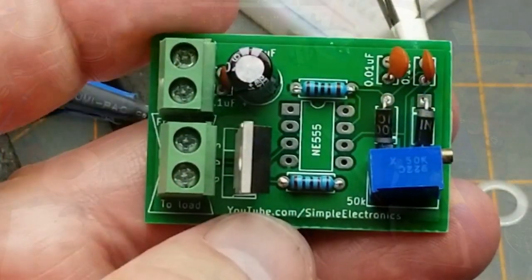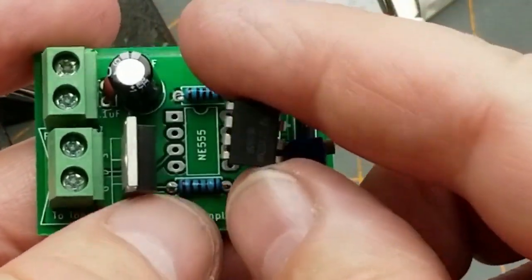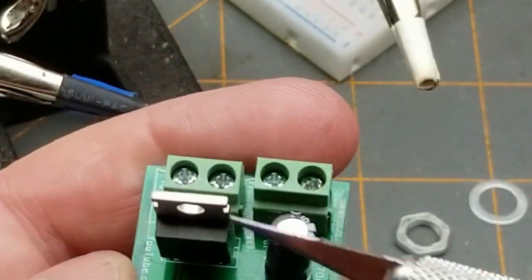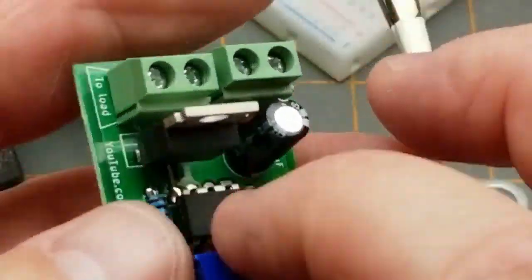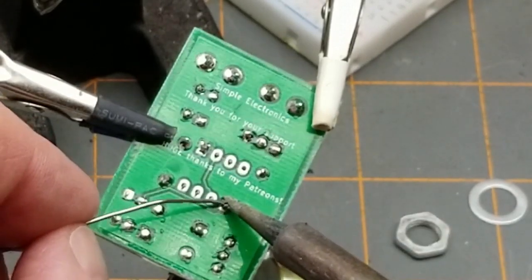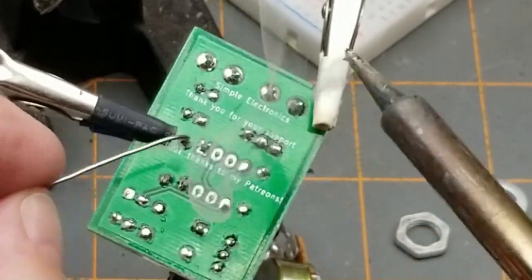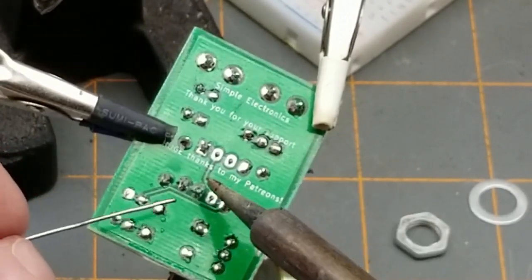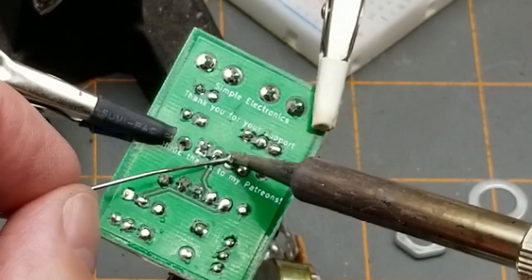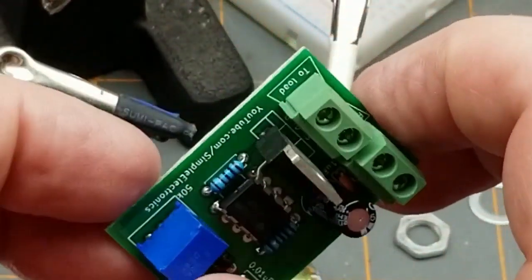Just the chip left. As usual, there's a notch marking and a square pad both indicating pin 1, and the chip itself has the same notch indicating pin 1. Just drop it in there, nudge it in a little bit, and do a quick solder job. To be nice to the chip I'm going to spread the heat around, going from one corner to the other and taking my time. Wait — that one doesn't feel like it's all the way through.